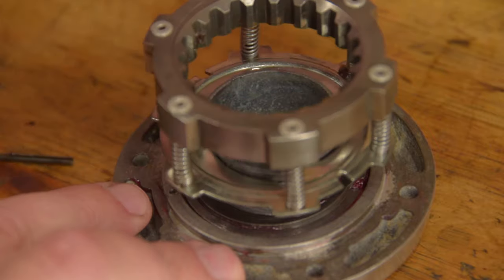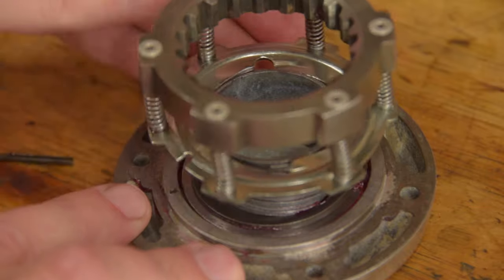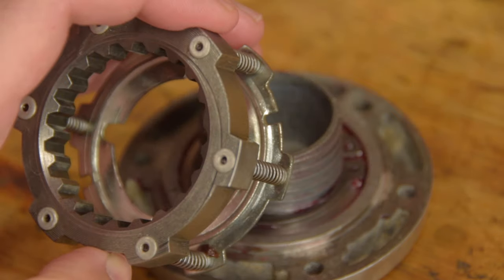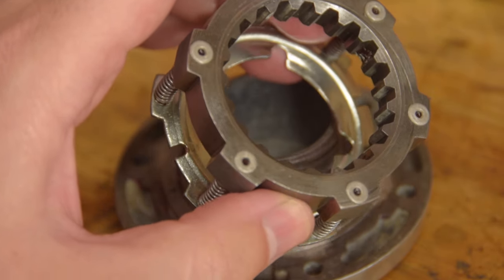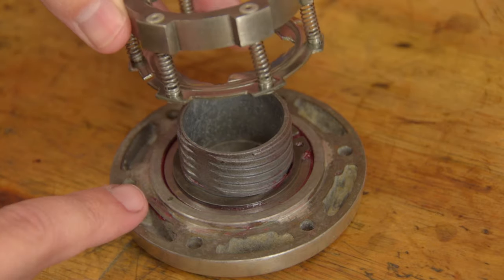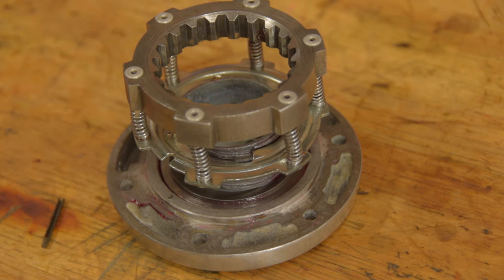There's really only one trick to putting these things back together. You can see the base of the gear springy thing is a stamped thread. There is a little peg which hooks into one of these holes to keep everything in line. This is the only bit you can stuff up. The peg has to go into the correct hole so that the gear is clocked correctly. You can see they've helped us out by punching a little triangle next to the correct hole. There are four positions this can thread on. You want it so that when it just fully engages the thread, it's clocked so that the hole with the triangle next to it is above the hole for the peg.